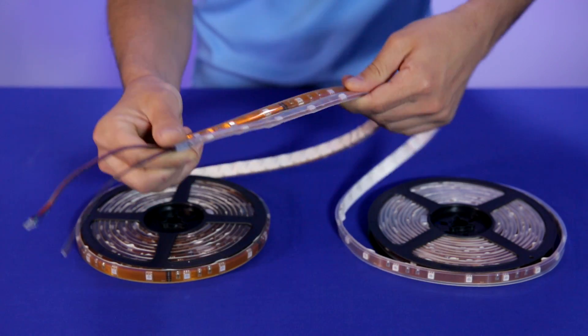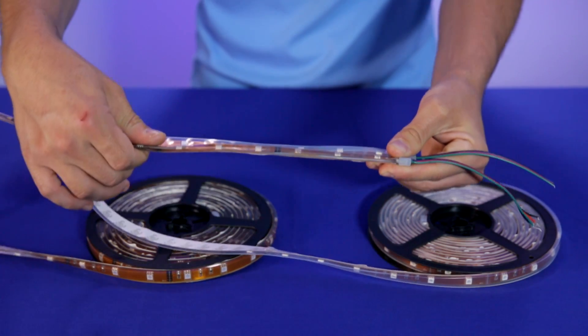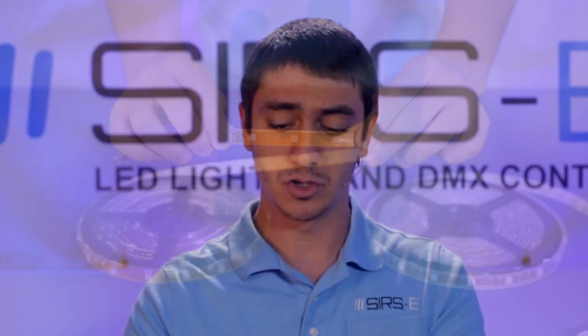The main difference between them — the diodes, the board, and everything in them — is the same. But the main difference is the actual covering. The IP68 has double protection: it has a silicone exterior sleeve and an interior silicone gel. So it is encased completely from both sides, it is harder to feel, a lot stiffer to squeeze, and more heavy duty. It will resist more PSI under water.